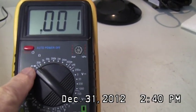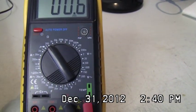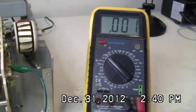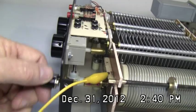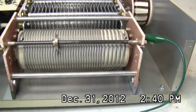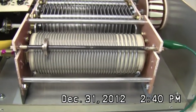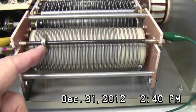You hear a nice steady tone, and the meter says 0.001. That's in the diode check mode — if I go to ohms I'm showing 0.6 ohms. The diode check with tone is much better for this. Now I've got a tone I can listen to as I crank. You can see this slide going across, and if you listen the tone has not changed — there's a good solid connection.